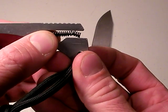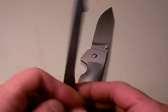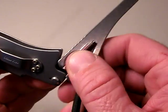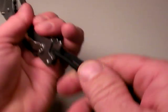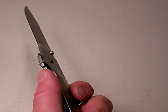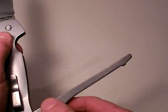I've had enough experience with springs to know — once it looks like that, you're pretty much done. That is a spring that is going to be non-functional. It's got a kink in it and does not work anymore. I attempted to put the knife back together. There's your retention pin. I put the spring back in, and the notion would be to pull it back enough to recompress the spring and reinsert the plunging bar underneath the blade. But once that kink is in there, even if you try very hard, you will not be able to compress that spring and get it back in. The knife is non-functioning and completely broke.